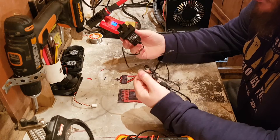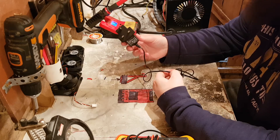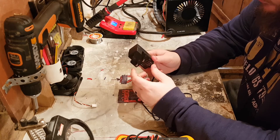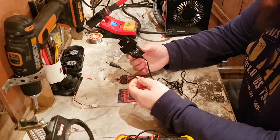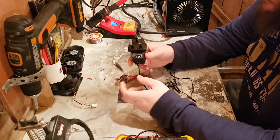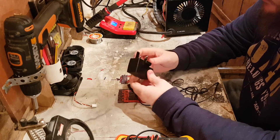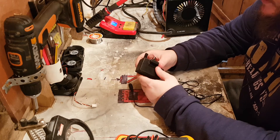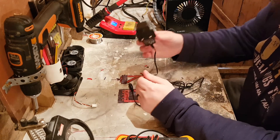The first thing I'm going to do is plug it in, work out which lead is positive and negative, then hook it up to the fans to make sure they're working, and then get it ready for fitting into the welder. I could leave it as two separate plugs, but instead I'm going to take the power supply apart, find the connections, and run the fans directly into the welder's internal power supply — no extra plugs, inside and out of the way. That's the best way of doing it — less mess.